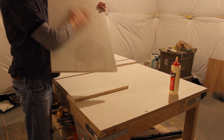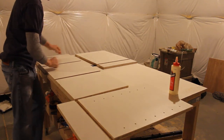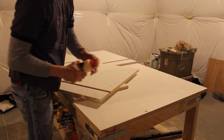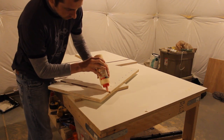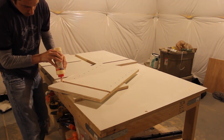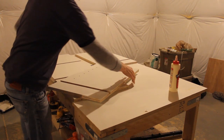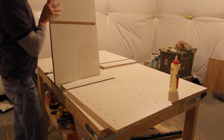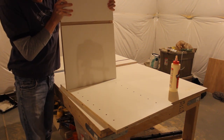Now that all the pieces are painted they basically look like I bought them at IKEA — they've got grooves, they've got shelf pins, so we're ready to assemble. This is why I love doing grooves and dados, because it makes assembly so much easier. I'm putting some wood glue in this dado groove. This is regular plain wood glue — if this were outdoor furniture you'd need a Type 2 or similar, but this is for indoor use. I'm putting a nice big bead of wood glue in there, standing the piece on edge, and intersecting the bottom piece into that groove.